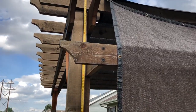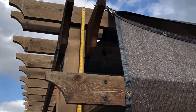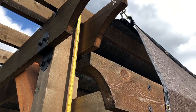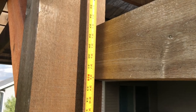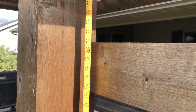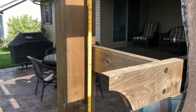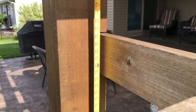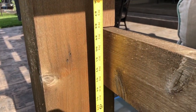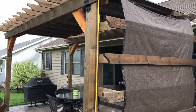For the side screens, here are your measurements: the top of the first board should be at 27 inches, the second board at 47 inches, the third board at 68 inches, and the fourth and final cross piece at 88 inches from the top. Hopefully that extra detail will help you get this built, if this is what you wanted to do.